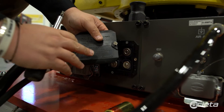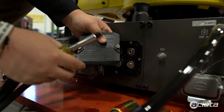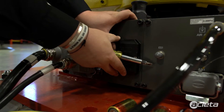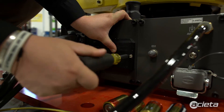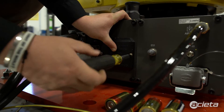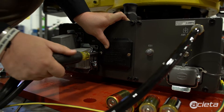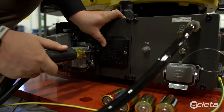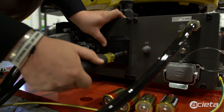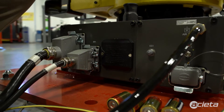Putting the battery box back on, make sure that the FANUC lettering is facing towards the ground. Put the battery box back on and start tightening the screws down, but make sure you don't over-tighten them — the bolt head is susceptible to snapping off if you over-torque it. Just nice and snug is all that's needed.